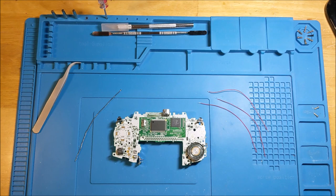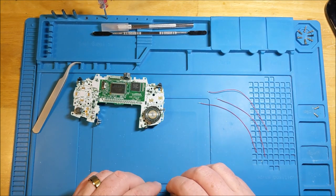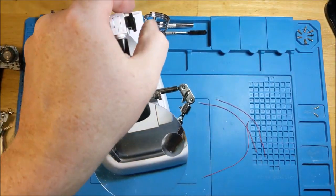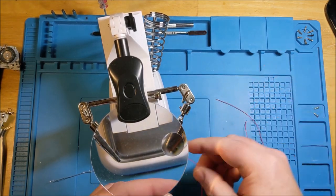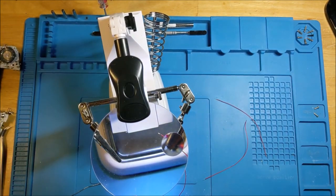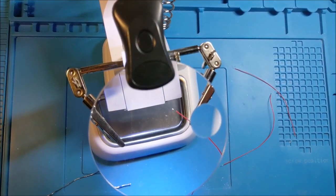So first off, my soldering iron is set at about 250 degrees. Now, the funny thing is, before we get to the board, you're gonna wanna tin the wire contacts. So, what I tend to use for this is my little micro soldering station. So I often tend to put these guys up on there, and then I have a solid place to go. If you can see in there, oh yeah, you should be able to see it right in. Awesome.